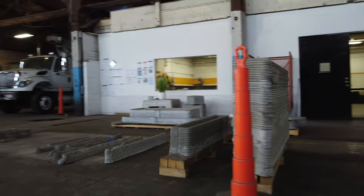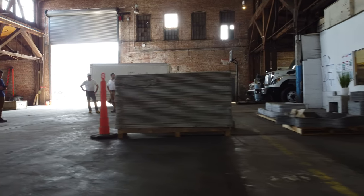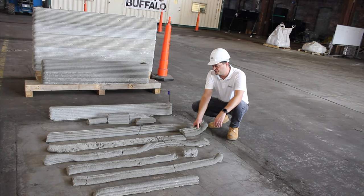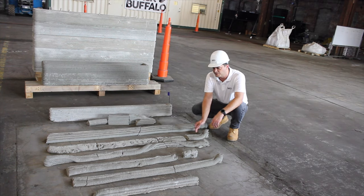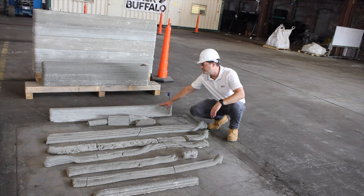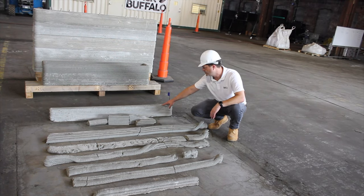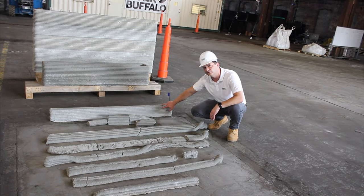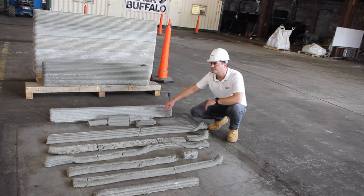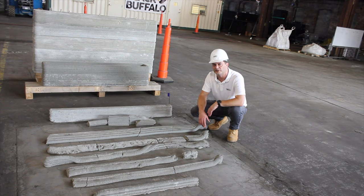If you look at this example here, you can see that not only did it not bond as one layer and not really support itself, but also it was a windy, rainy day — so we knew we had to change the formula. At times when we're doing test prints, if we're doing tiny runs, even a wall this big, going back and forth or doing multiples in a row, by the time it swings back around, we have to make sure the layer below hardens in time. Sometimes on one-offs and examples, even some of the furniture, we might use a hardener or an accelerant in between.